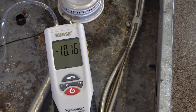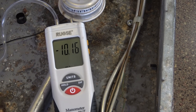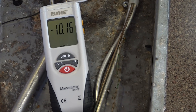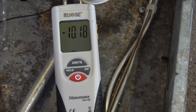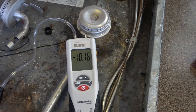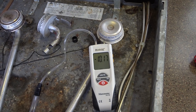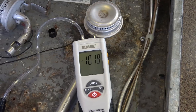It's not a very expensive piece of gear, but it does the job for what I'm trying to do. It does multiple units - I'll leave a link in the description. I can see that it's holding pressure right now. So what I'm gonna do is go turn off my gas cylinders on the RV, and if there are any leaks in the system, I should see that number start to drop as it depressurizes.